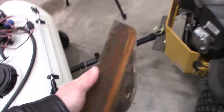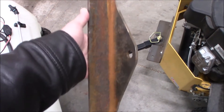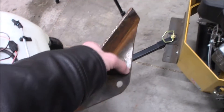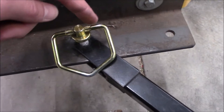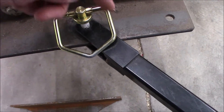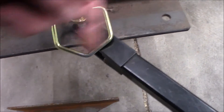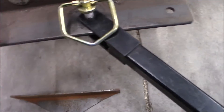I had this buddy of mine, and I think he may have bent these on a press brake. This may have been a flat piece of steel or it could have been angle iron, and he simply took the plasma torch. I could have done that here, but I don't have an actual steel cutting torch — I've got a map gas torch and a propane torch. Great for heating enough to bend, great for soldering, but not a true acetylene torch where I could cut that. So the other choice would be a cutoff wheel on a grinder or a pneumatic cutoff tool.